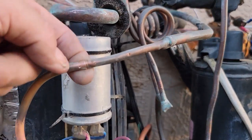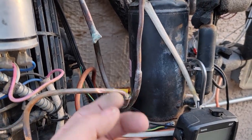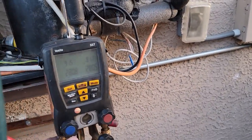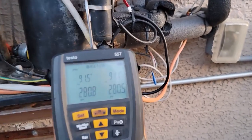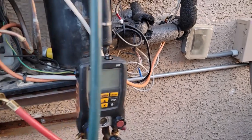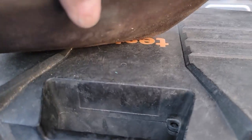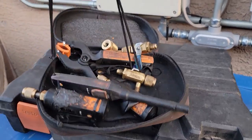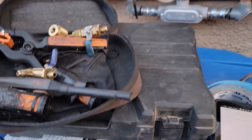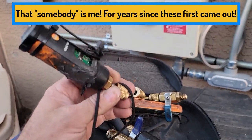This one here's got a better job on it. It should be ready to rock. Equalized at 280, which equals about 91 degrees — is that all it is outside right now? I'm surprised. I disconnected the manifold set and put it away, getting out the Testo. Some of this stuff's been replaced, some hasn't. You could tell somebody that's used this stuff.